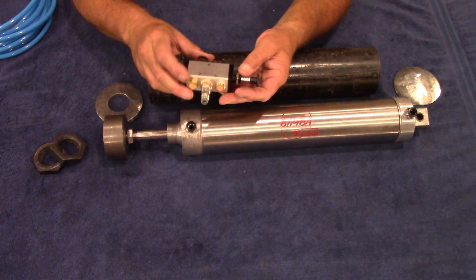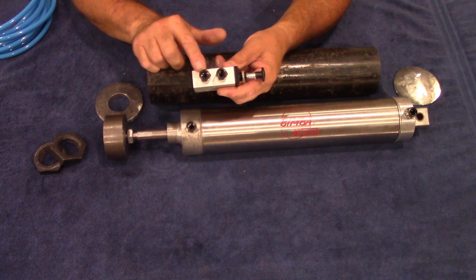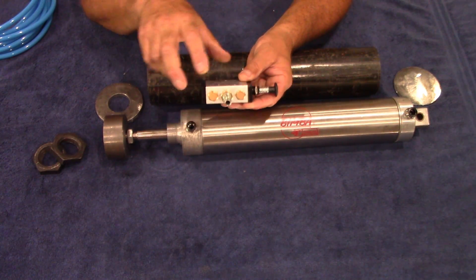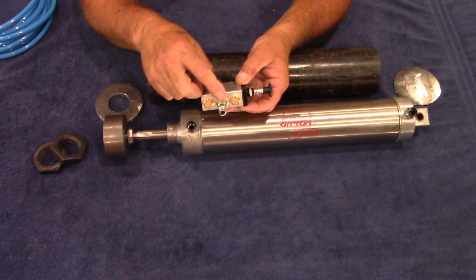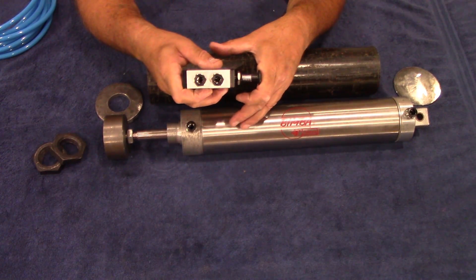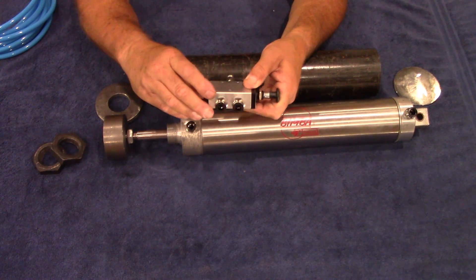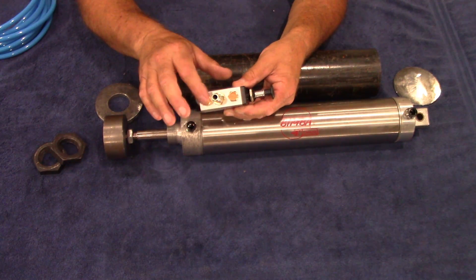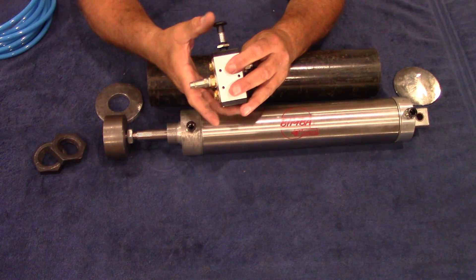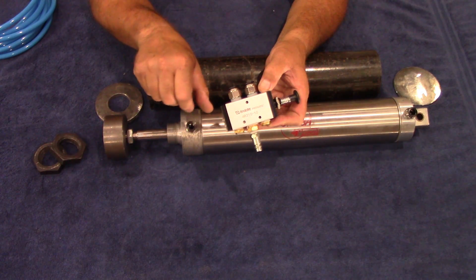Let's talk about the 2-5 valve. The reason it's called a 2-5 valve is because it has five ports: two charge ports and two exhaust ports, plus your line pressure from the air compressor. The air comes in and one of these ports is charged at all times. When this button is pushed, it exhausts one port and charges the other — that's why you can't have a closed loop, it has to have an exhaust port for each charge port. I added a spring on here so it returns on its own.